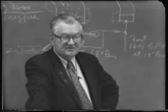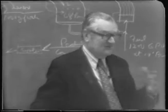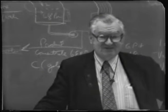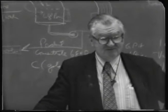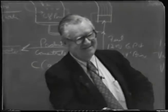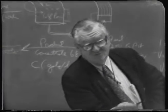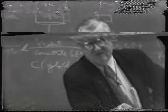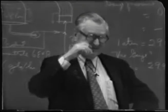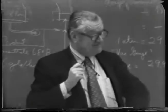In other words, in this answer you'll get, I don't know, maybe 9 or 10 or 11 or 12. I think it's over 9 anyway. Ideal trays. Well, of course, if it's 75% efficient, that means you have to use 4 for each 3, doesn't it? In other words, if you add 4 actual trays and they're 75% efficient, that'd be 3/4 of 4, which would be 3 ideal trays. So if you measure off 3 ideal trays, in reality you've got to have 4 trays to make 3 ideal trays.